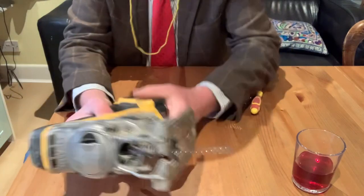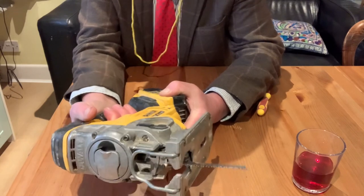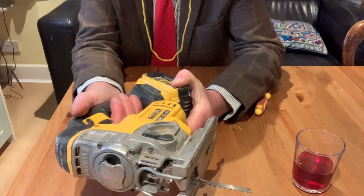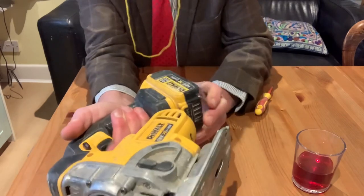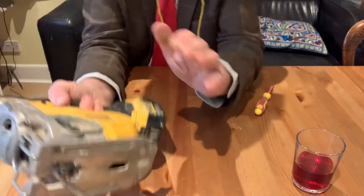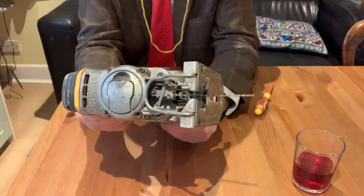So what is actually happening with this jigsaw? Well, it's got an intermittent fault — there's a loose connection. If you squeeze the trigger, you see, nothing's happening. The battery's in and we've got no power running. So give it a bit of a bash. There we go.